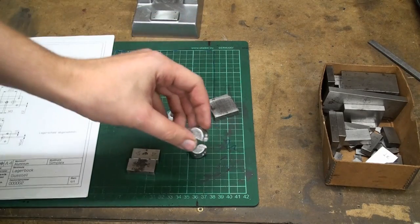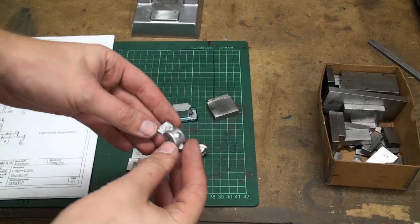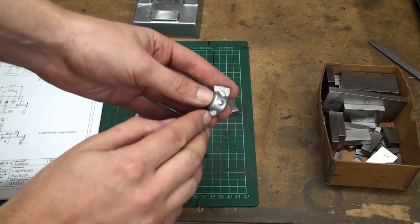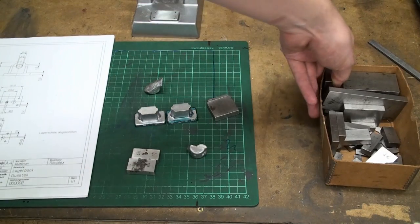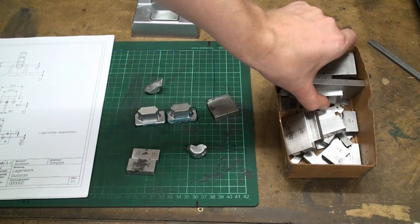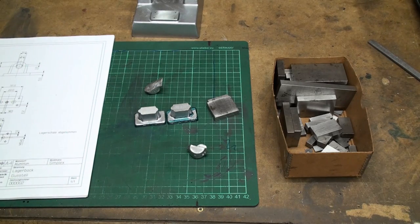Surface, and now we're going to machine the bearing caps, which also have the big sprue on here. But the problem with those is they don't have a flat surface on the bottom where you can rest them on a parallel. But they have these two spots where later the bolt holes will be. And I figured out, I'll take my box of old gauge blocks. Really, if you have a machine shop, you should have a box of old gauge blocks that you can use and abuse for setup. Don't use your good gauge blocks for that purpose. Or do it and suffer.